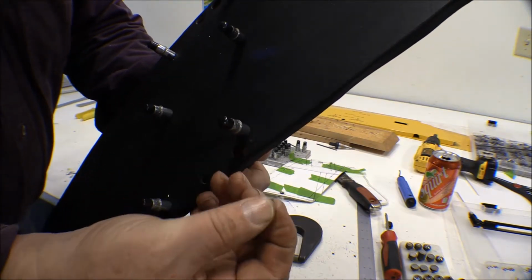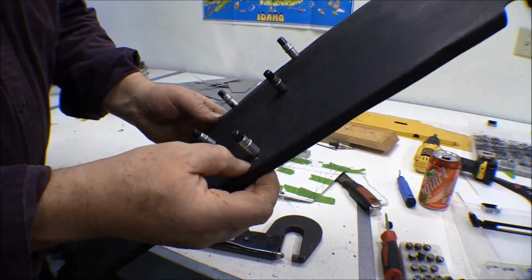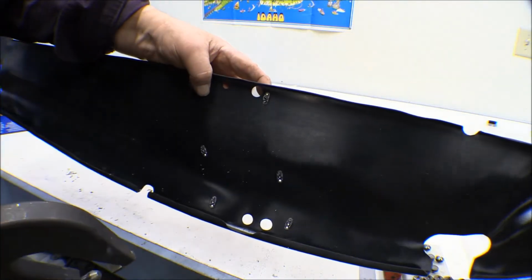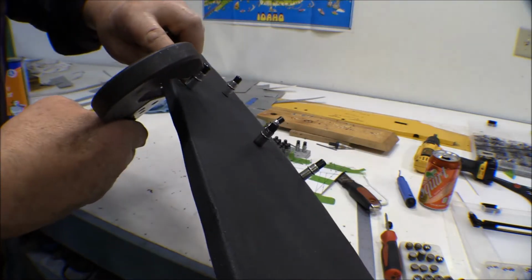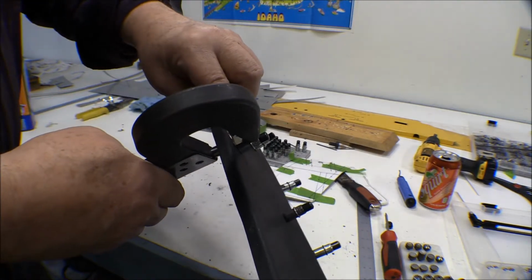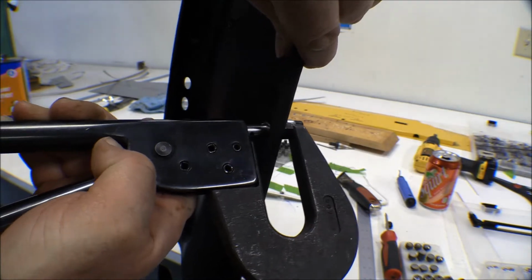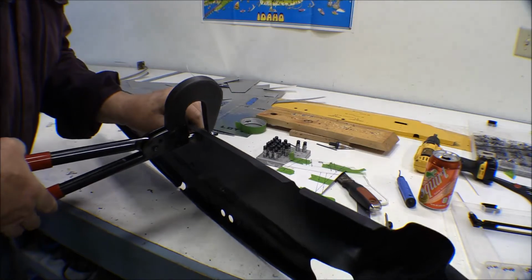And see, I've got these little rivets, and I countersunk the other one, but I'd forgot that on this Kydex I don't really need to countersink it because it's soft enough that it'll just squish in. Well, it's probably better not to countersink it. Now I can get this head here over close to that cleco, and get this anvil here centered on that rivet on the back side without interfering with that nut plate, that floating nut plate.